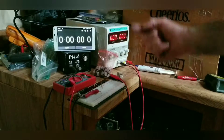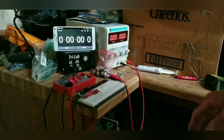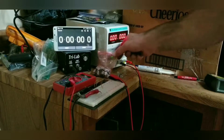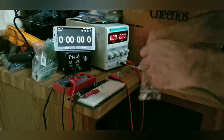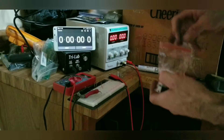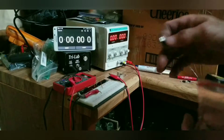We're not driving them linear — they don't start to go linear until 4 volts, which is about a 20% margin below our 5-volt gate signal, so we're safe there. Now we need to select a MOSFET out of this bag completely at random. We're going to use the same MOSFET for all the tests. That one's got bent legs, that one's scruffy looking — oh, there we go. Looks like a good, completely random MOSFET.